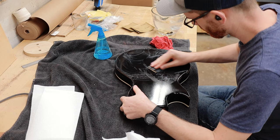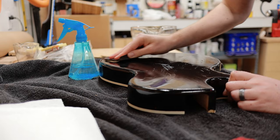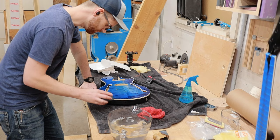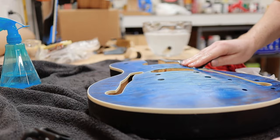It's been about 20 days or so, and this lacquer is real solid. I've decided I'm going to go ahead and wet sand this. There's still a little bit of orange peel from the lacquer finish, and while I think this is generally pretty good and you don't need to do this next step, this is a whole experiment. So I want to try going the extra mile and learning how to wet sand and polish a guitar. Wet sanding sucks. I used 1200 grit paper with a little foam block, and just started working on the guitar one section at a time. I really think this step is absolutely worthwhile though — just take your time, go slow, and I think you'll be really happy with the results.